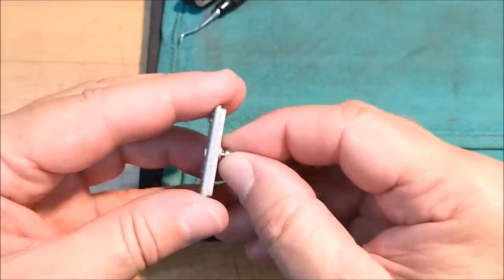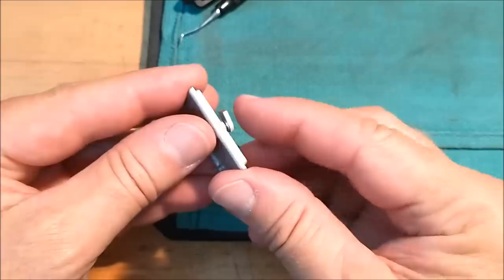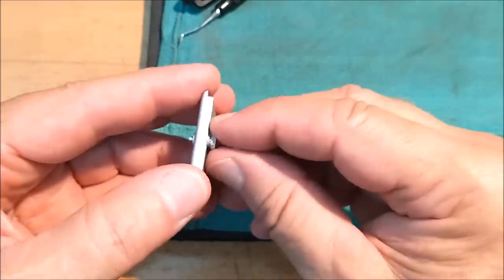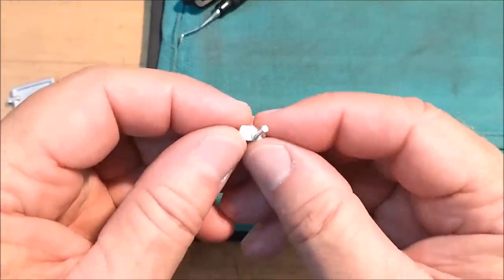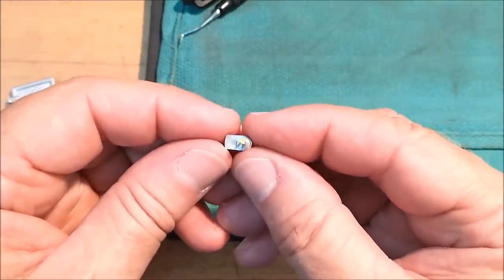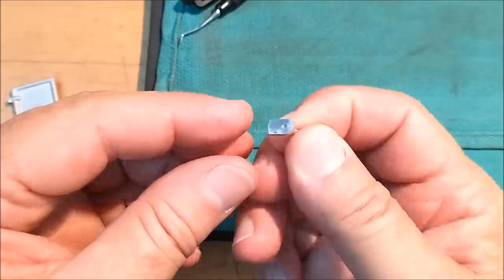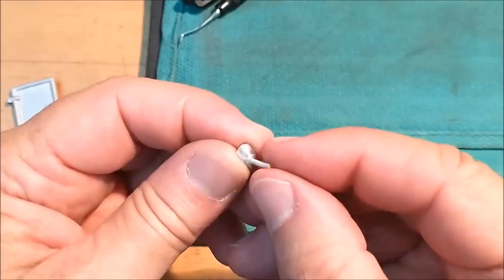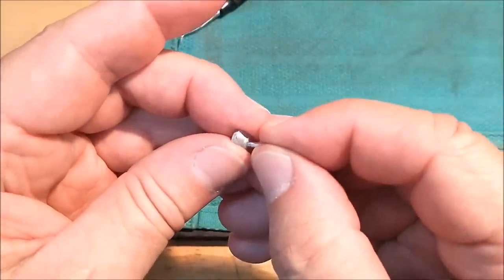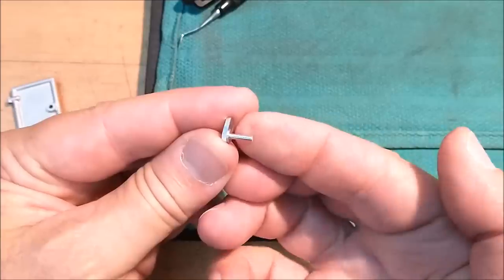come through the door, and we'll press the handle on, press the knob on after the fact, and get everything to work that way. First part we're going to make is the cam, and because it is offset like that, I can either use an eccentric collet and turn it off center, or just start with a larger diameter. So if you see me starting with a larger diameter, that's why. I'll turn the whole thing down, put it in a spin indexer, turn the cam section on it, and then we'll put it back in the lathe and part it off. Let's do it.